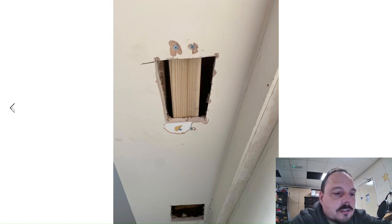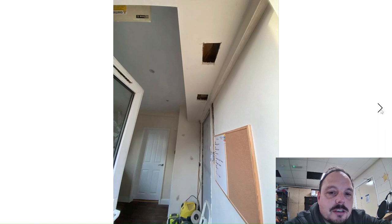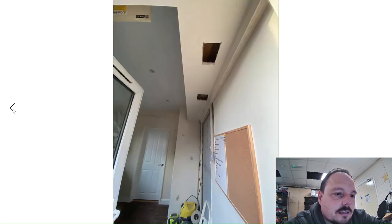There was a bulkhead running along the wall that leads to the hall — a really narrow void with a funny construction. It was actually quite a big bulkhead but there's a timber floor about 100mm up, so we had to make some access holes to run our cables underneath. This is how we patched them back up — timber batten across the top. You can see what I mean about the access: there's like a floorboard there but no access above it, as it's in a void underneath the bathroom floor. These are the holes there, and also the spotlights in the ceiling — all up and in with minimal damage.